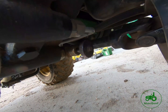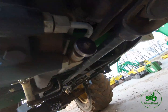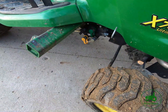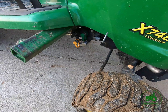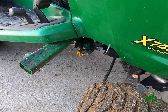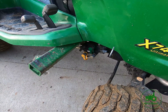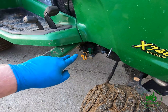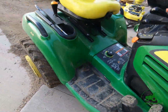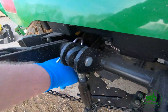You can see it right there at the end of my finger, and you can see how it attaches. What it does is it shuts off the flow to one set of hydraulics, because the X-series is only an H2, so there are only two hydraulic outlets. But there are three functions: two functions on the valve, and then mower deck lift and three-point lift, which is the same function, moving via this cylinder right in there.